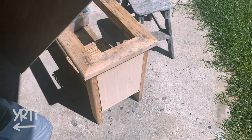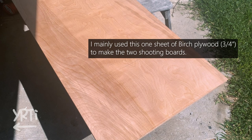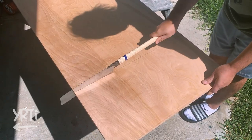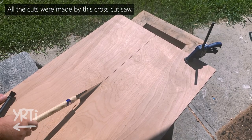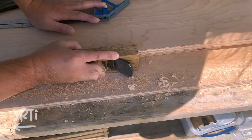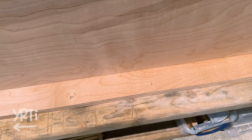I got this three-quarter inch Baltic birch plywood. It's two feet by four feet and so pricey. I wanted four feet by eight feet plywood for the price, but I couldn't fit it in my car. People usually say it's no good to hand plane on plywood, but I didn't want to use a circular saw to cut it straight, so this was my approach. I really know the glue in the plywood is hard and it damages the planing iron quickly, but I don't handle plywood in general and it's just one time, so I didn't mind it as much.